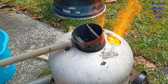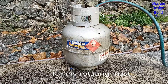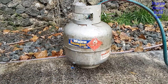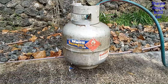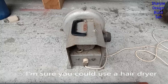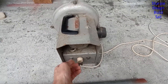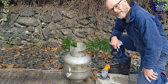Welcome back. In this video I make my wood-fired smelting furnace out of scrap and cast some ingots. To make the furnace I need a few things. I need a housing that the fire is going to burn in, and I'm going to use this old LPG bottle. I'm washing it out first and leaving water in there when I start cutting. I'm going to need a blower — my friend Brent loaned me this one, and it has variable speed. I'll start by cutting the top off.